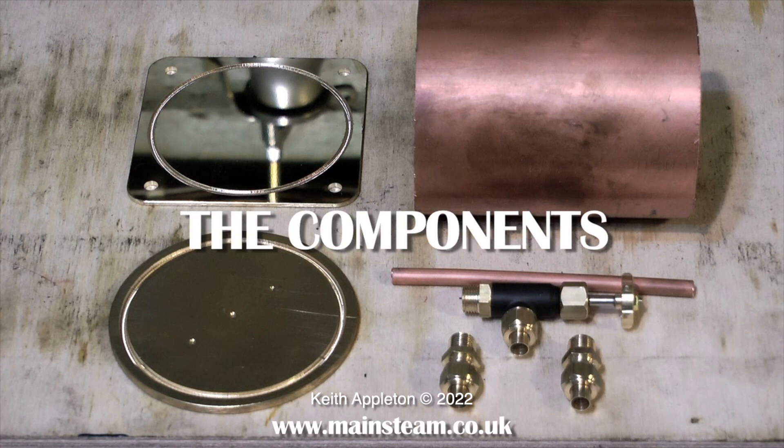A piece of copper tubing and a special base and top — I used to have these made by a local engraver, but in the end I stopped and just made them from normal pieces of brass. I used the engraved parts because I thought they would be stronger, but as this is not a pressure vessel I soon realized that a normal solder joint would be okay.